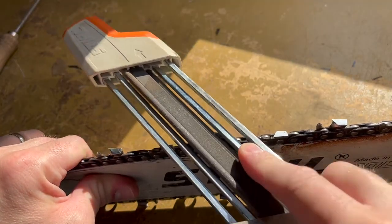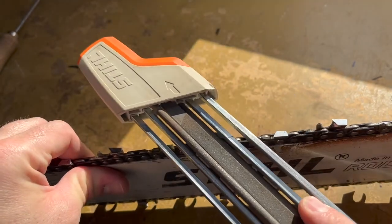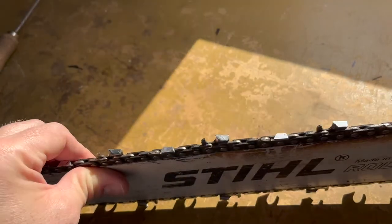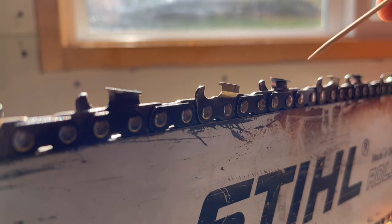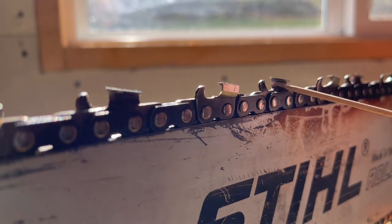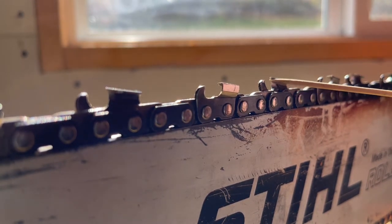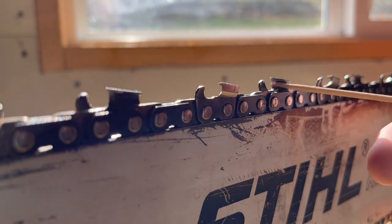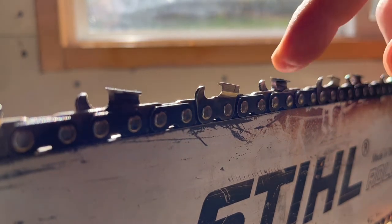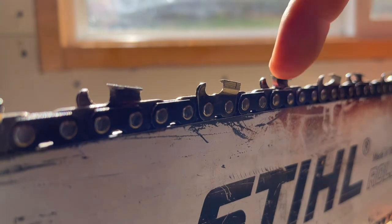In close-up, you apply a little pressure back toward the cutting tooth. You can feel when things are going well — there's a slight drag on the file and you hear a nice cutting noise with chips coming off. After a few swipes with the three-in-one we see a nice shiny flat spot on the depth gauge from the flat file, while the round file works in the rounded area of the side plate — the gullet — sharpening that side plate edge. The file also removes material from the underside of the top plate, sharpening the leading edge there.